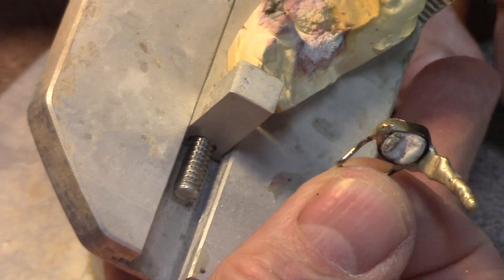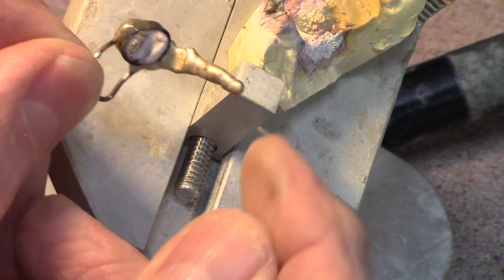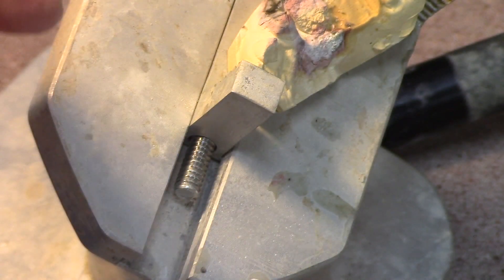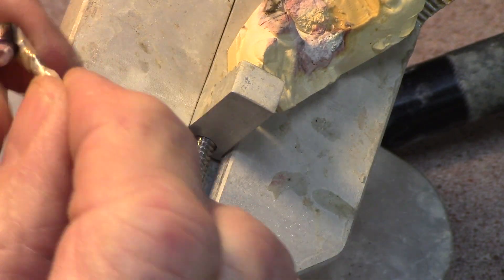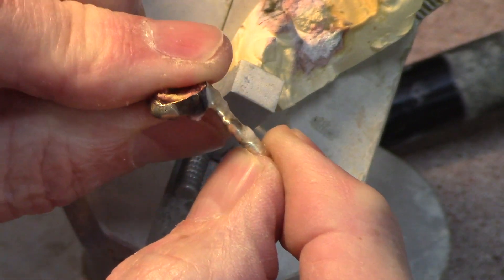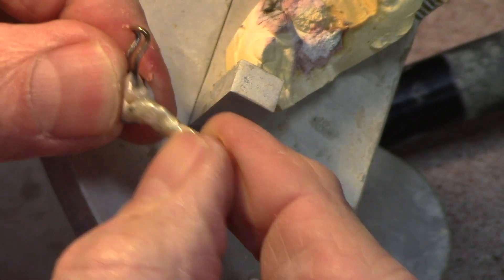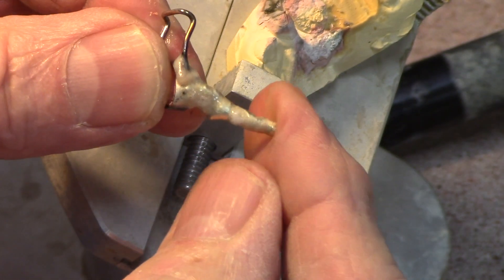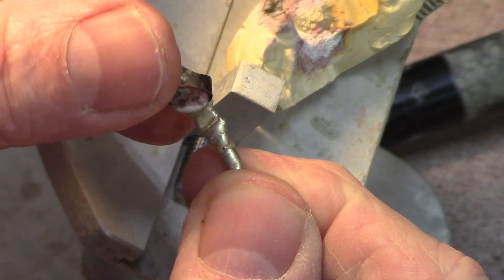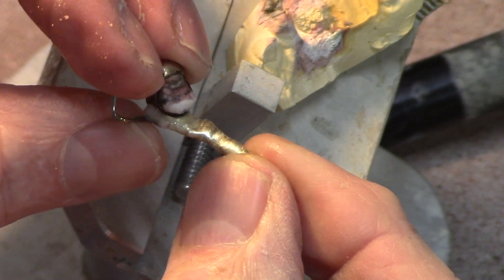About to burn the lab down here. Once you melt the solder onto the wetted solder — let me quench it there — you've got a strong solder joint. That is strong. So then you can just melt this solder onto the wetted solder and build up your bulk, cover all the wires, cover the ends of the wires. Once you totally encase the wires, you've got a very strong solder joint — if you've got it wetted well.